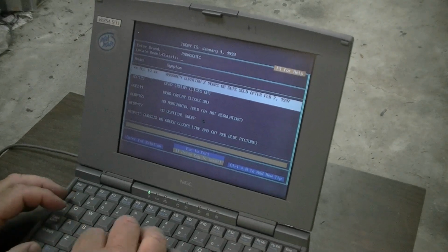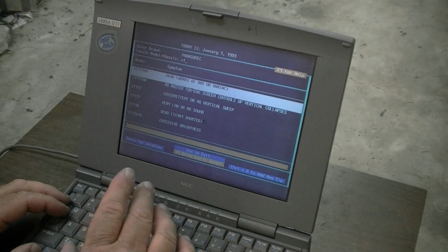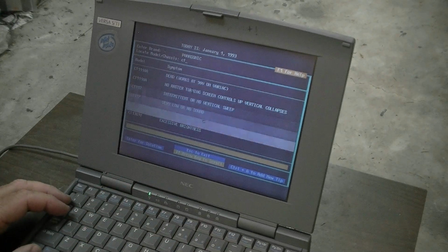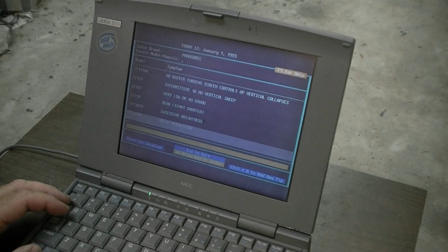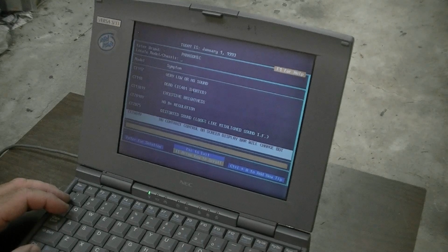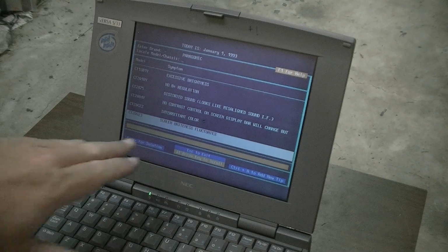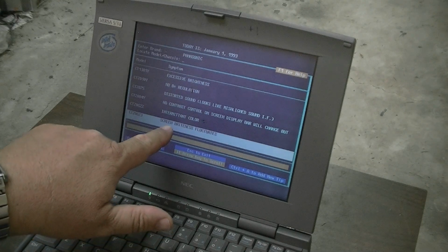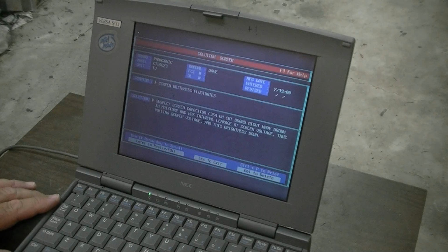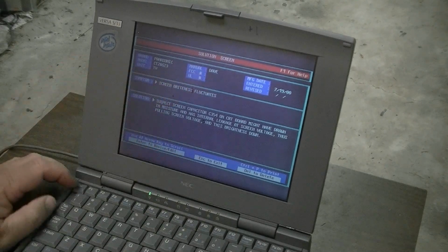But if I just search out like CT, which is one of the common model numbers, PC is another. There's no tip specifically for this particular model, because I've never had it before on this smaller set, but I did have this type of symptom on a larger set. So I have this one here on a CT20G23. Screen brightness fluctuates, and this one was a suspected screen capacitor, and it's got my name on there, so I know that that's mine.